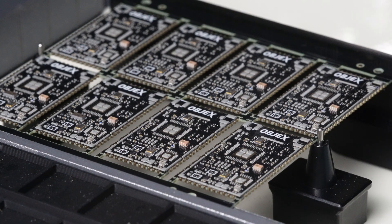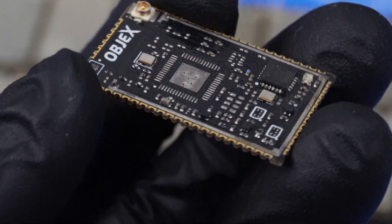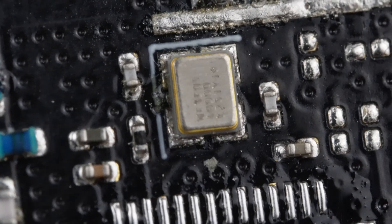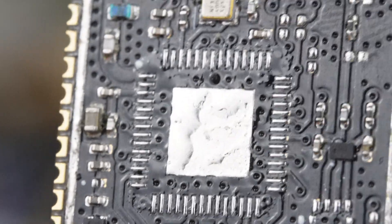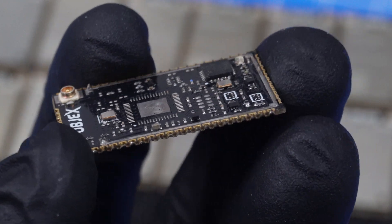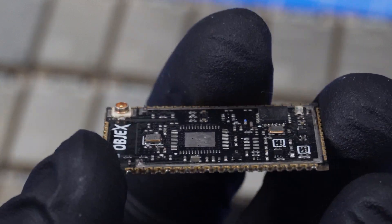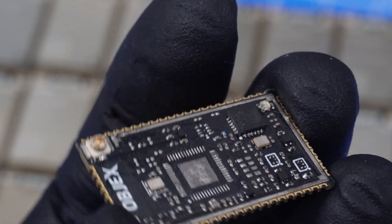Producing LPMs is extremely complicated, simply because of the size of the components — 0201 and smaller, many of them passives: resistors, capacitors, inductors — all smaller than a millimeter. Assembling by hand can be done, but only two or three pieces and it takes a lot of time. The only real alternative is to use a pick and place machine — a machine that automatically positions these components — and that's exactly what we'll do. I'll show you the result after several hours of calibration so you can understand how complex and miniaturized this design is.